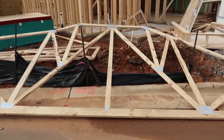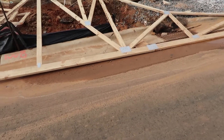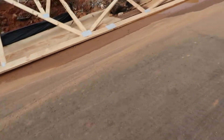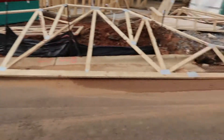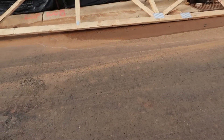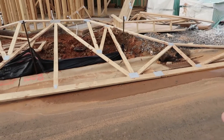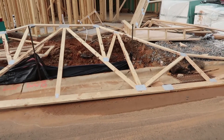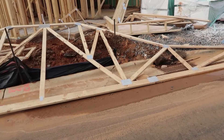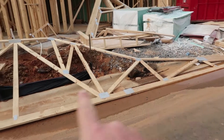You have an open floor plan. The more traditional roofs would have a knee brace here and a knee brace here, and then this would be a load-bearing wall. If it was on a crawl space, there'd be a pier under there and under the two ends. But with a truss system, you can basically transfer the weight to the outside and leave all of this open for an open floor plan without needing a load-bearing wall. As long as you do not cut or compromise any of this engineered truss — it's basically like a truss bridge that has to span a long area without any kind of pier — and they do that by transferring most of the weight to the end points.